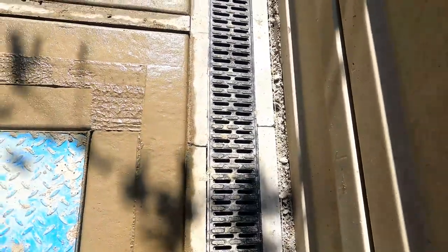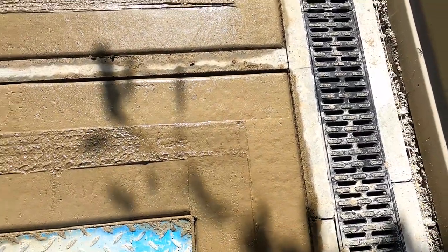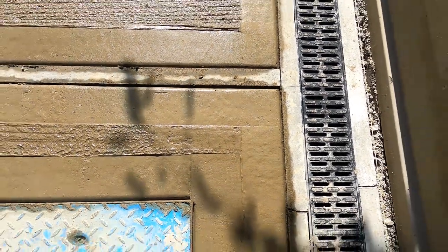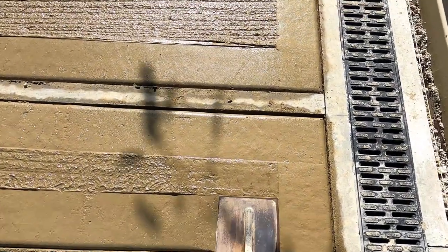With your concrete and trowel, all you're going to do is draw that through there like that, and you can go over your edge and trowel again. All that does is just join the two up so you don't get any marks going in like that. You want that to be nice and flat so it's a continuous edging all the way around, and I just join them up like that.